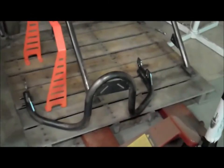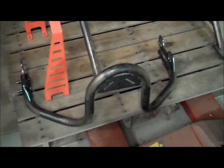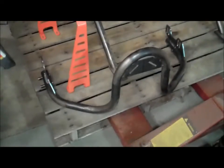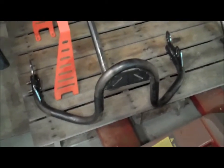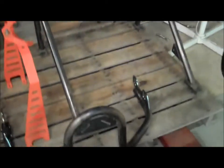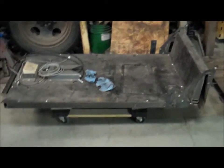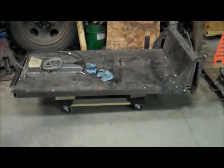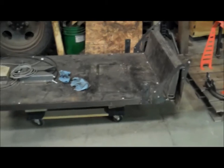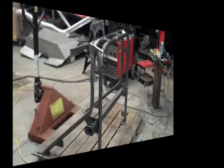We're going to focus on the safety bar hoop that I'm going to TIG weld, so it's got really nice finish welds on there, no spatter or anything, since it's right around the client. And then we've got the ramp roll bar, going to work on that as well. And then from there I'm going to move into the ramp assembly here. There's a shield underneath that I need to fabricate up to protect the air cylinders that run that ramp flipper. So that's what we're going to hit on here this time, and we'll go from there.